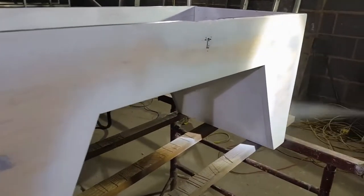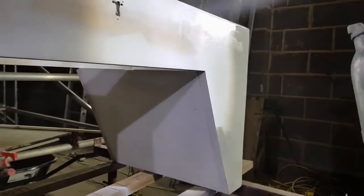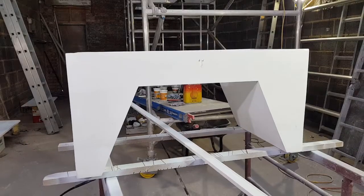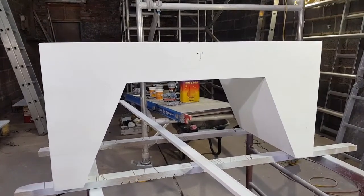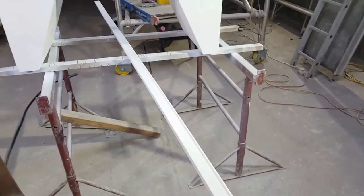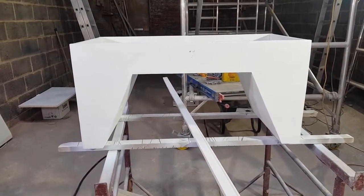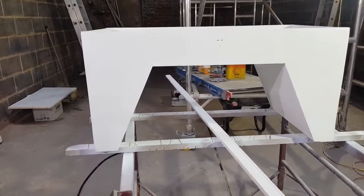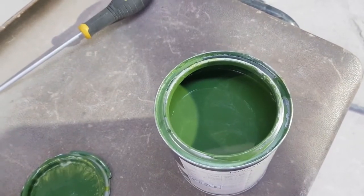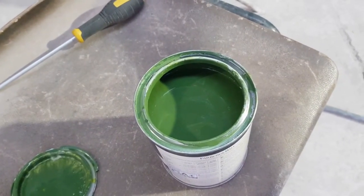I've taken the lid off the trunk and removed the timber moulding that was nailed to the lid — because it doesn't run all the way around the perimeter and has seen better days, I plan to make a new one with a similar moulding just to give it an original look. The coffee table is ready to be primed and painted, and now I'm going to start the prep for the lid. My original plan was to preserve the old distressed look in resin, however I'm going to give it a facelift with a marble effect on 12mm MDF stuck to the original board. The contemporary marble effect should go well with the lift-off hinges — they'll complement each other.